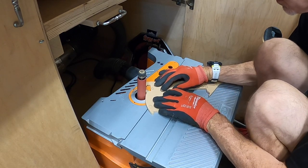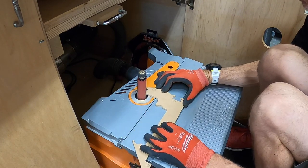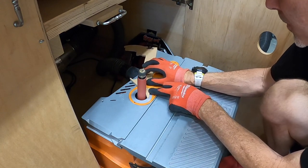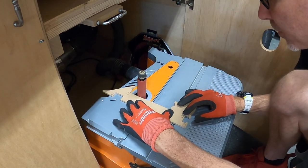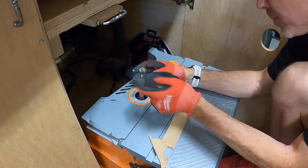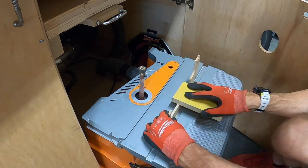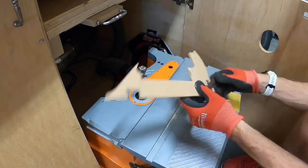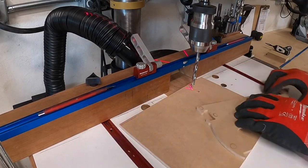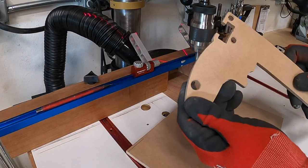Okay let's move on to the sanding. I'm using my brand new shop modification sanding center here, which is really nice — it's coming in handy. Basically I want to carefully refine all these edges. The saw did a good job but left a pretty rough and uneven surface, so I'm just trying to make it as smooth as possible. The bigger diameter drum was okay but I'm going to switch to the smaller one for these little half circles. After the drill press is done all these holes are finished and I use a backer board to protect the back.